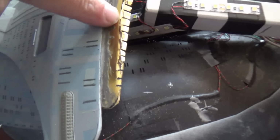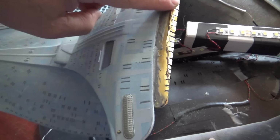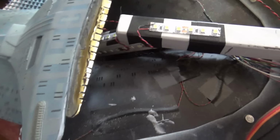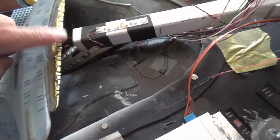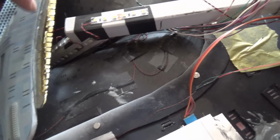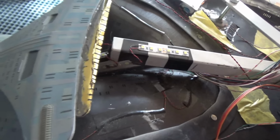Okay, here is that piece of brass. Now you can see where I've cut relief cuts into it, and I've bent them down. I knew that sticking up was going to be too obvious and it was going to be in the way. It's looking like even a little bit more of this has to come out. But like I said, this brass is very soft, very easy to cut with a grinder, Dremel tool with a grinding wheel in it. And I can trim these guys down, and it's something that I was not going to know how much of that needs to be cut until it was in place. And like I said, it's easier to take care of that now since I had used the full width of the brass piece to stick it in place.